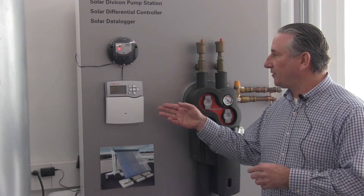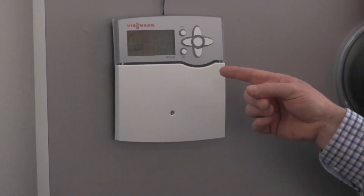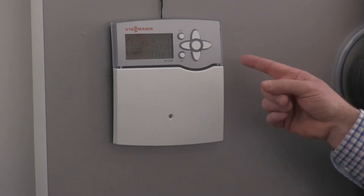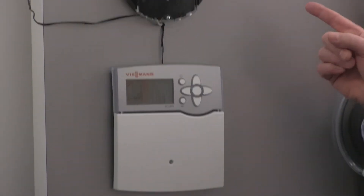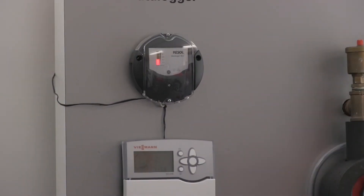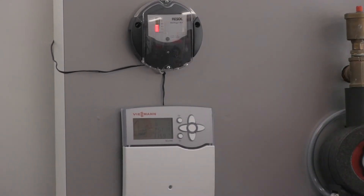This particular control is a sophisticated multi-load control that has a variety of different options. You'll notice on the screen here that there's a display showing the actual configuration of the system and also the various temperatures of all the sensors in the circuit. Above this, you'll notice there is a data logger — a device hooked up to the controller to record on a daily or even hourly basis how much energy has been produced. This can be valuable in tracking the performance of your system to find out if it's working up to its maximum.